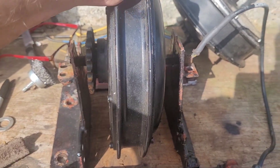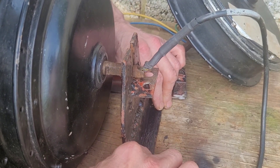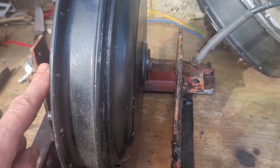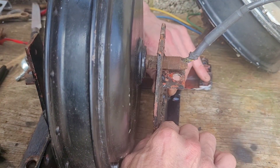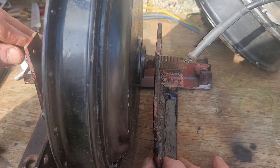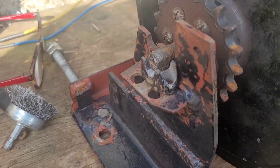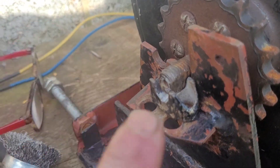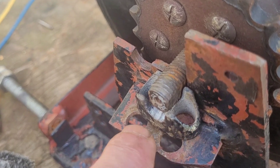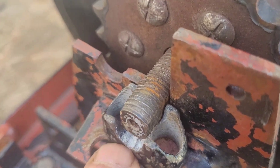I'm well happy with that. This is going to give us a little bit more wiggle room. Actually, now that's going to be too much. I think what I might do is weld this on, and then drill two holes while that's welded on — I think that'll be easier. So what that means is we've got about 5mm movement backwards if we need it.